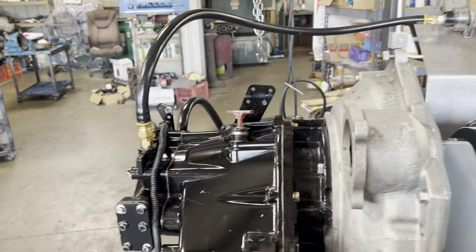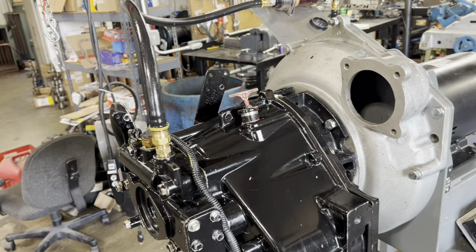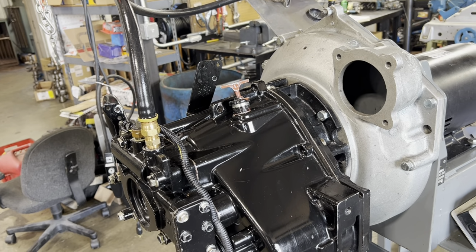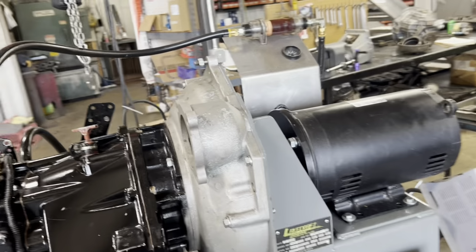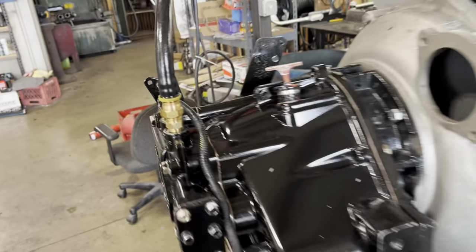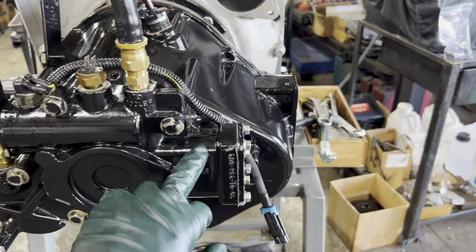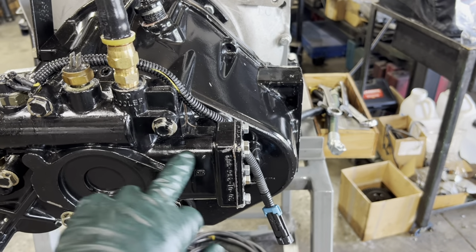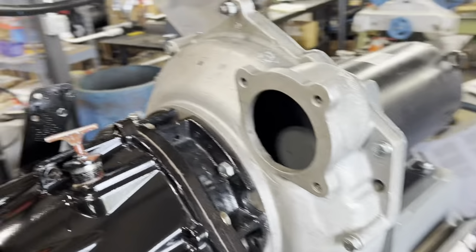That tells me I have a leak in one of the clutches. Specifically, it's gonna be the input shaft clutch, I believe, because I have cooler flow one direction, not the other. That tells me I've got a huge leak. That kind of eliminates the pump because cooler flow is a version of the regulator. So the regulator's right in here. When the regulator blows off, this thing should be about 300 PSI.